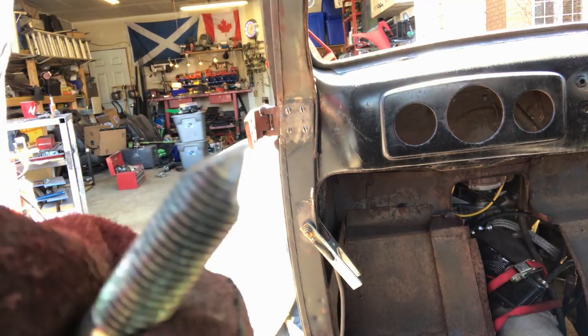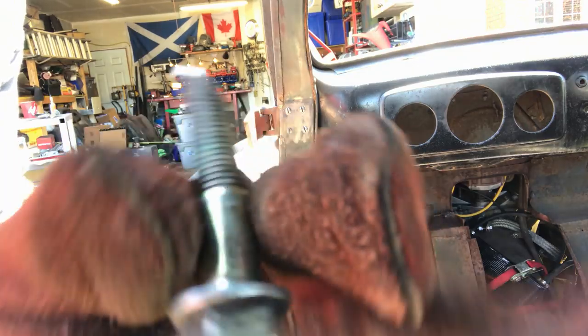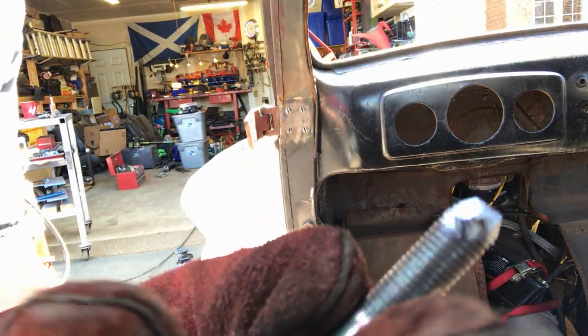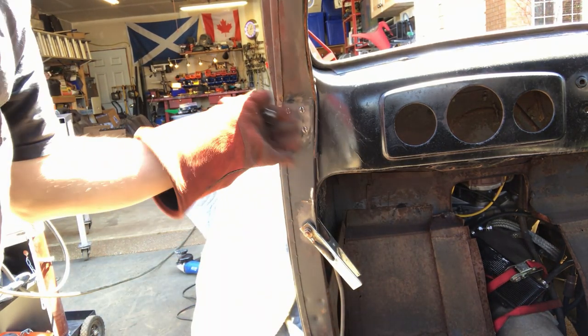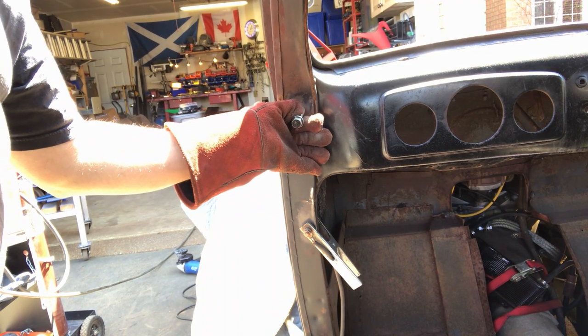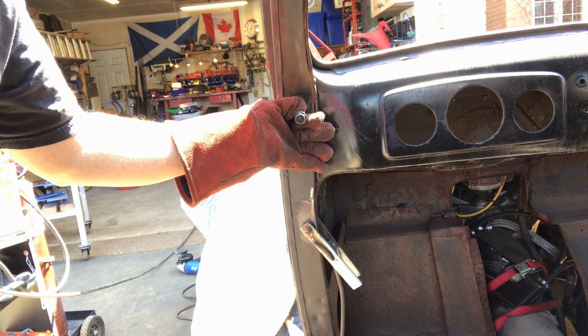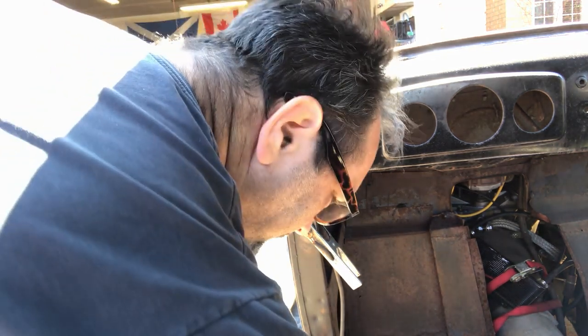Okay folks, here's the plan. Obviously that's just a 17mm bolt. I have plenty of them if I have to make new ones. Sharpen to fit the screw heads, just weld these in place, and then by magic, when I turn that, it'll release the bolts, hopefully.